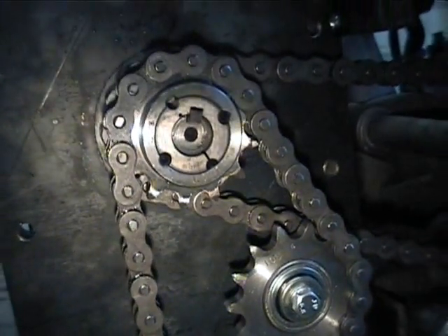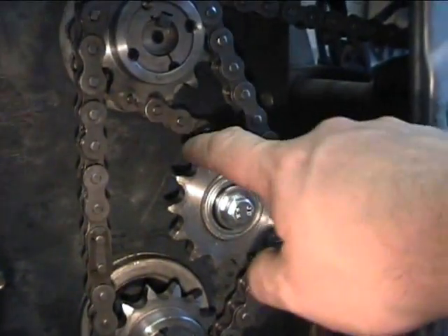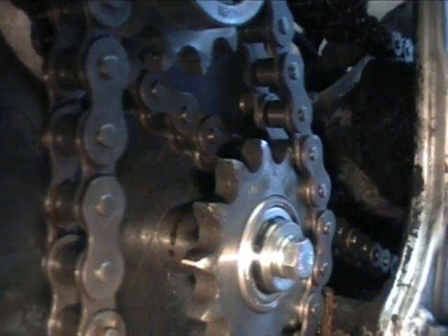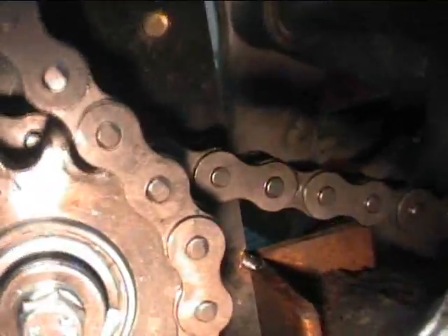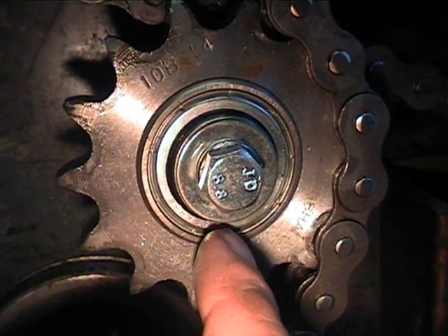Because of the way the spacing between the shafts ended up, I couldn't get the chain to be a happy fit. It was either too short or too long. So I fitted this idler sprocket here in the centre to take the slack out of the chain. I just turned a little bit of 25mm steel to make a fitting for that, and that's drilled all the way through. The plate is tapped M8 to take a through bolt, which basically pinches that down on there. As you can see, it's just a sprocket — it's got a metal shielded bearing in the centre of it so it just spins around.